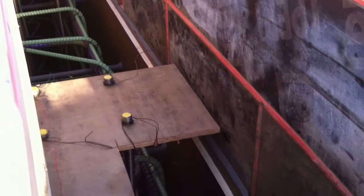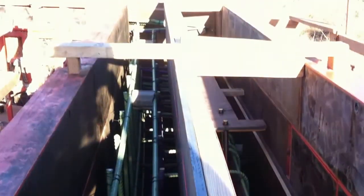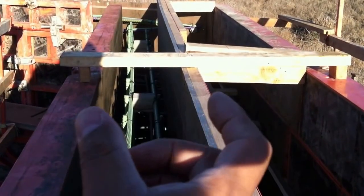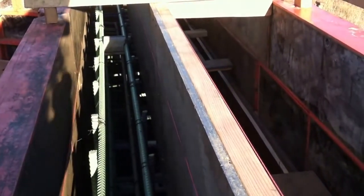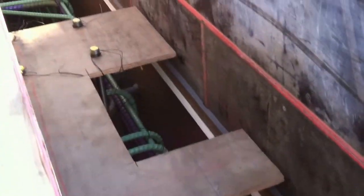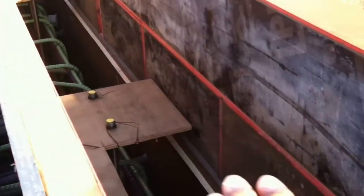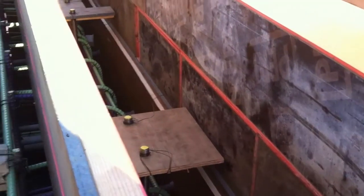This is what it looks like down inside there — I know it's kind of hard to see. This is what we like to call a sofa seat abutment style up on top. It will have a stem wall that comes up. This is relatively thin here that comes down, but then once it reaches about two feet or so, this part flattens out. You can see where it flattens out over here and then it'll drop down. The stem wall beyond this point will be pretty sizable, maybe three feet deep. Up here it's pretty narrow.